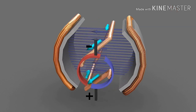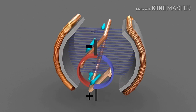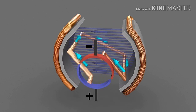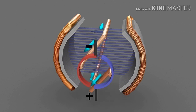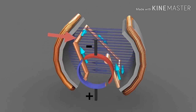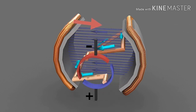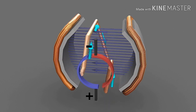During the rotation of the loop, we can find that commutator segments come in contact with brushes of opposite polarity one by one. This way, the conductor of the left side always carries current in this direction and the right side in the opposite direction. This helps to maintain continuous rotation of the coil.